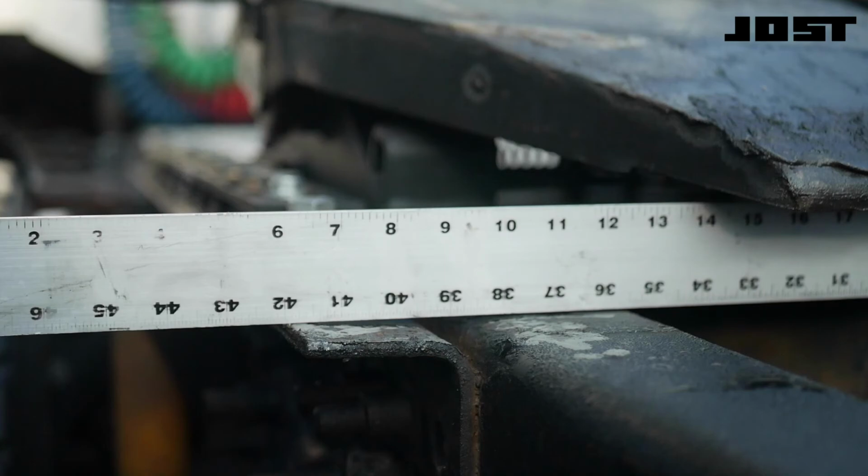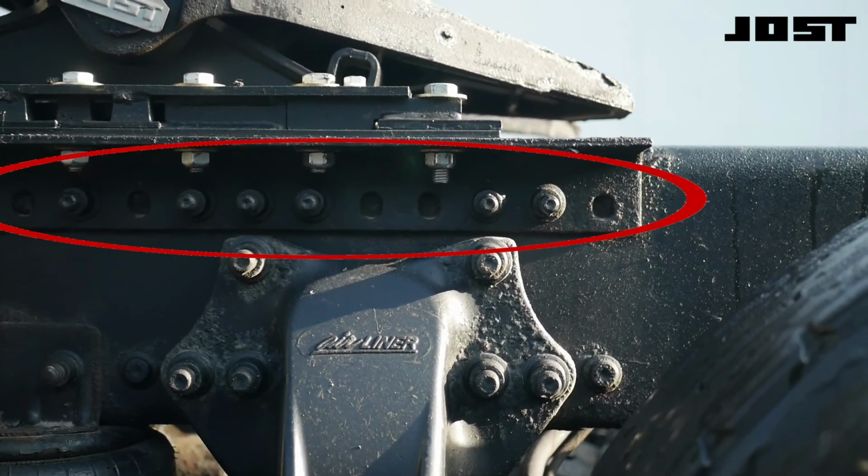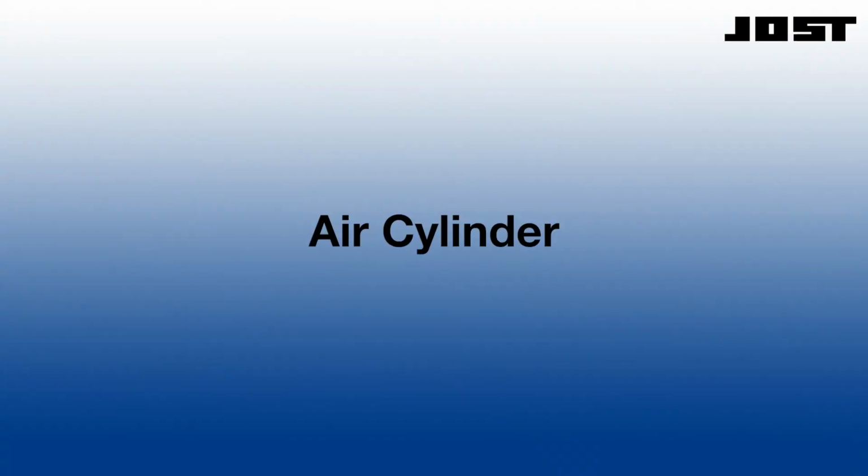To correct mounting angle elevation problems, loosen all of the bolts securing the mounting angles to the tractor frame. Adjust the mounting angle using a straight edge to place the mounting angle flush with the top of the frame. The fifth wheel remains installed for this step. In most cases, the mounting angles will spring back up when the bolts are loosened. After properly aligning the mounting angle, tighten all mounting bolts to their proper torque.